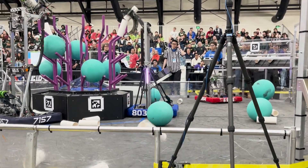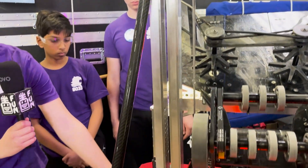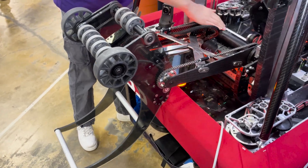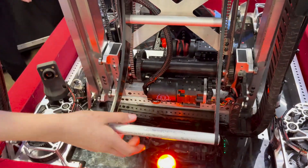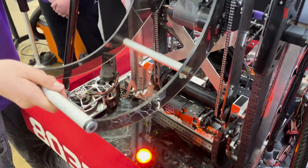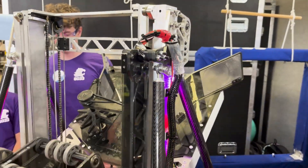So first we have a two-stage cascading elevator — this is a max-height elevator. We made it pretty narrow to avoid racking, and we have carbon tie rods on the sides which form triangles so it's more stable. The elevator has a crossbar which helps prevent racking, and those four carbon tie rods each weigh about a quarter pound.